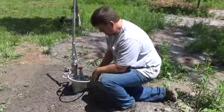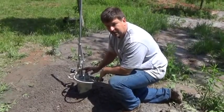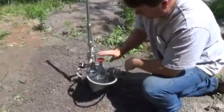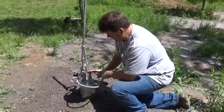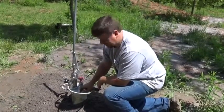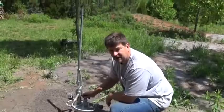We've just finished up the submersible pump install and set everything on the Simple Pump cap. It's so much easier this way. If you're thinking about putting a hand pump on a new well, put the cap in place first, then plumb up from the bottom for the other pump. You can do it the other way, but doing it up front saves a lot of time and aggravation. If you're putting in a backup well or new construction, put the Simple Pump well seal in place first and then plumb to it. Signing off — another job with Engineer 775.